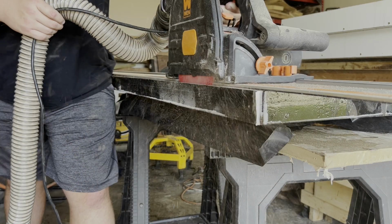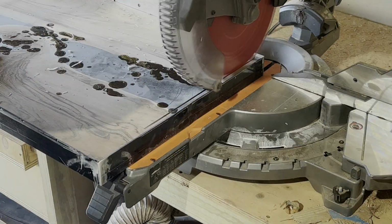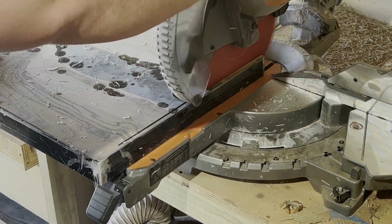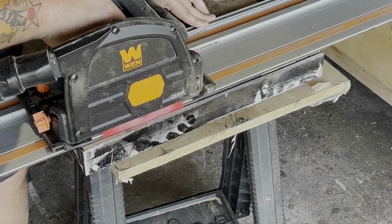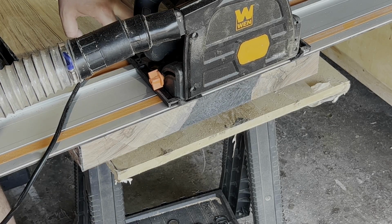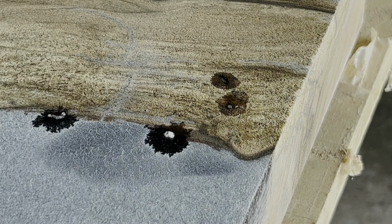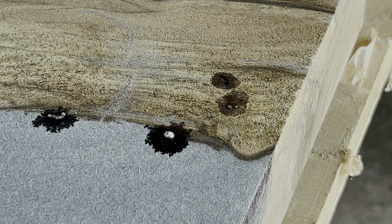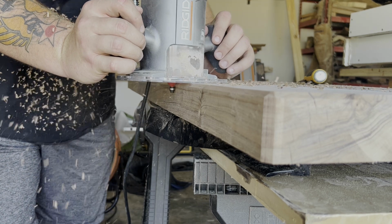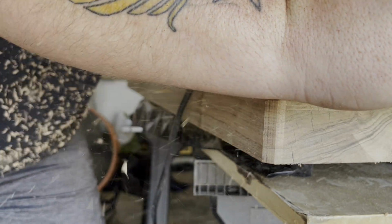Now, what I was not able to show because it was kind of an emergency, I think it was maybe late at night, is that the epoxy actually overheated, right? This deep pour epoxy overheated and cracked. And that's my fault. We've been having a ridiculous heat wave in Texas lately, just like most of the central United States has been having and dealing with. I poured the epoxy on a day where it happened to be over 100 degrees for multiple consecutive days, and heat and epoxy don't really blend well, and that's going to come back to bite me because of how I filled those cracks.